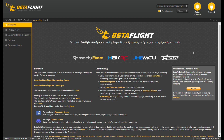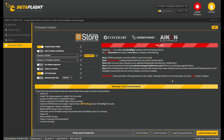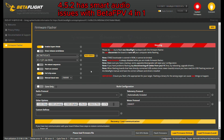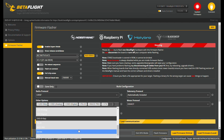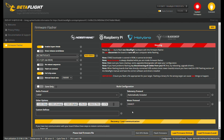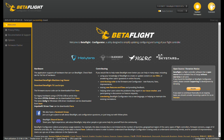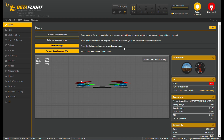Now it's time to configure our drone in Betaflight. Before changing settings, I want to go over the firmware update tab. You always want to flash your board to the newest stable release of Betaflight — in our case we'll hit auto detect and flash 4.51. Betaflight 4.6 is coming soon, but for now this is the current stable release. I like to include Race Pro in my options, which lets me quickly change throttle and motor limits via the smart audio menu. To flash, hit 'Load Firmware Online' then 'Flash Firmware.'